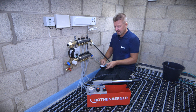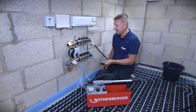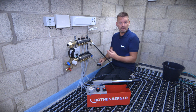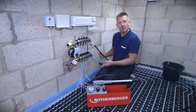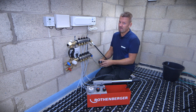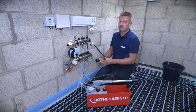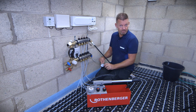Now depending on what pipe you've used — whether you used multi-layer pipe, PEX, or even PERT pipe for your installation — you will get what we commonly call stabilization. That can also be affected by the ambient pressure and temperature conditions of the installation and what sort of day you're working with. So don't be surprised if you pressure test the system, take it up to your necessary pressure, and then it just stabilizes and drops a little bit. If it drops to zero then yeah, we've got a problem and need to investigate and check all the connections. But losing half a bar, even up to a bar in that first half hour, can be common. If that happens, repressurize it to the correct pressure and just make sure it stabilizes.